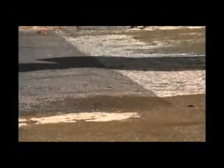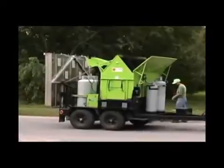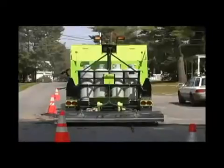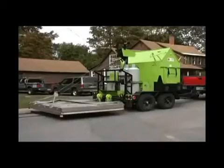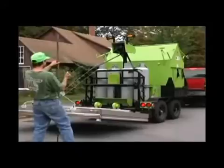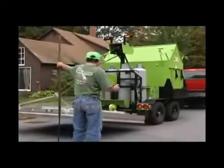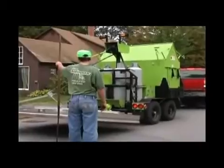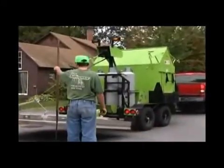This creates a thermal bond within the surrounding pavement and eliminates cold joints and seams. Using our 2-ton mini combo, we will demonstrate the techniques to put Raytec infrared to work for you. The mini combo is an asphalt reclaimer and pavement heater combined on a dual axle trailer. In this example, a utility cut, the unit is backed into place with the heater in the down position to make sure the area heated has adequate overlap of 12 inches between the cut and the surrounding pavement.